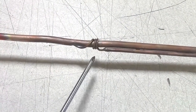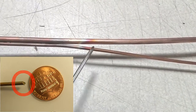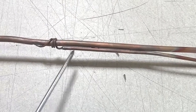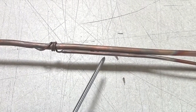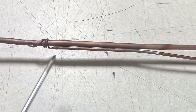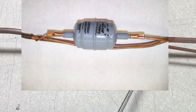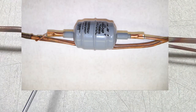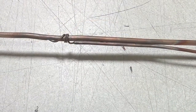Due to the very fine bore inside the cap tube, any piece of debris or any small particle that is in the liquid line gets forced onto the end of the cap tube in this section and will most likely clog it. Evacuating the system will not clear any debris from the cap tube. You will have to install a cap tube filter in this area — we have a kit at Coastal Climate Control available for that. It must be done by a technician and that will eliminate the problem and stop any further ones if there is further debris.